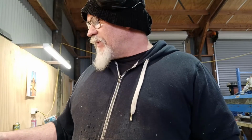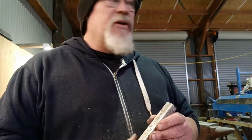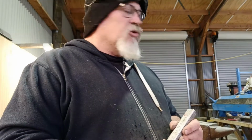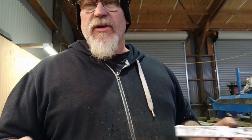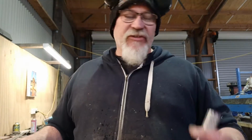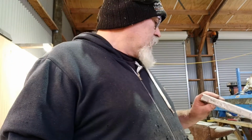Like I'll probably buff them up or sand them with 800 or something like that, and then give them a light buff so they'll be semi-shiny, if you know what I mean, without being shiny. I'll probably do that with some of the other aluminum pieces too, but I'm not sure with those big pieces for the floor. I'll just try and clean up the best I can. It's sort of a hard thing. It's so worn and so pitted and scratched, you can only get them so far. So I'll try and match this other stuff in to look sort of a similar finish, if you know what I mean. So I'll carry on and make this and we'll come back to you.